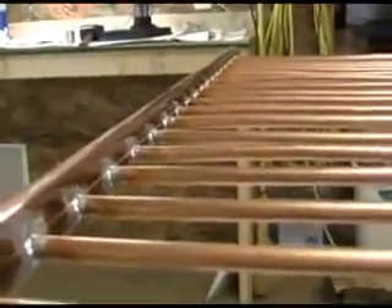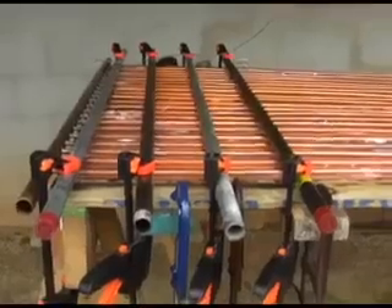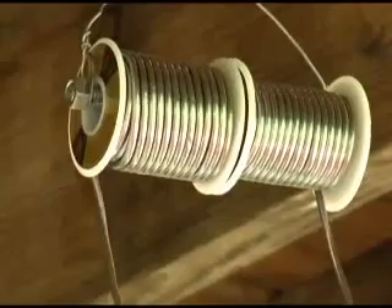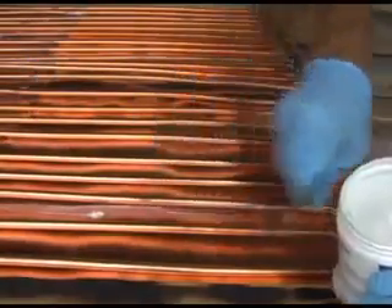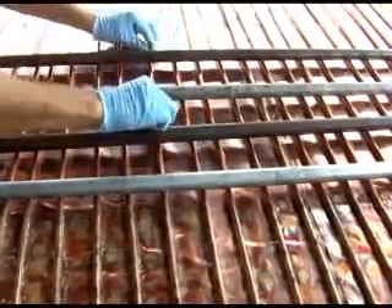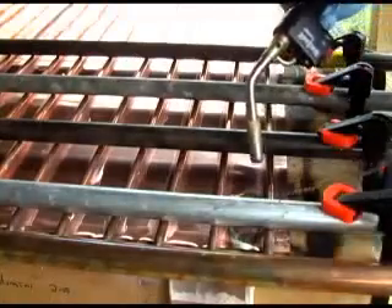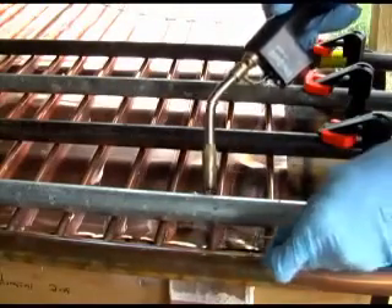Soldering headers indoors is okay, but the next step — soldering a 0.005-inch thick copper sheet to the copper tube — is best done outside due to the amount of smoke you will create. Press the copper sheet securely against the copper pipe. I've found 3/4-inch black iron pipe did a reasonable job. Have lots of solder available. I use 50-50 lead-based solder for this part of the project. I also use a water-based flux for this part of the project. This jug was good for about 3 solar panels. You can straighten the copper tubes that are wedged between the black iron pipes. You will spend about an hour soldering the copper sheet to the pipes. The soldering process causes the copper to ripple — this is fine.